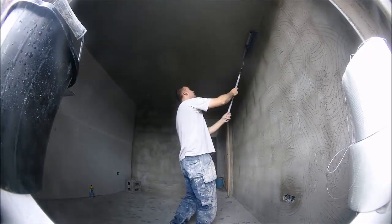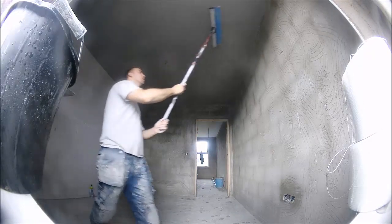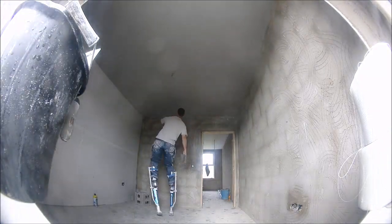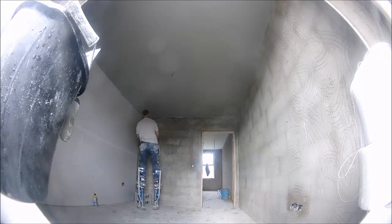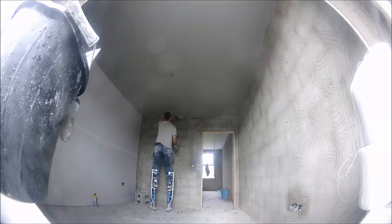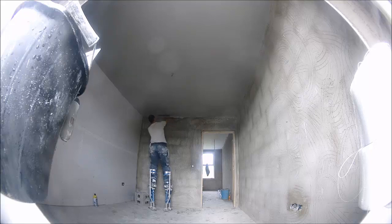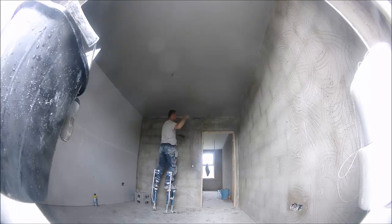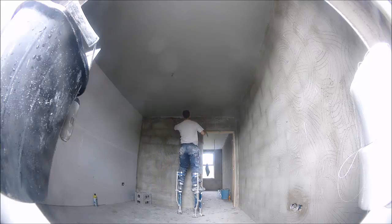I do recommend you try and check all your angles — you don't want any bumps or big hollows. This would still be the first trowel here. You may want to wet down your angles and clean them as you go. I'm working up against set cement here which does have a bit of suction, so I splash those corners a bit just to stop the edges drying as they will dry a wee bit where they touch the set cement.